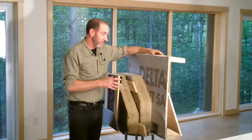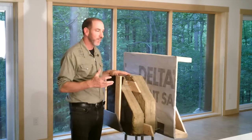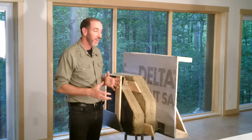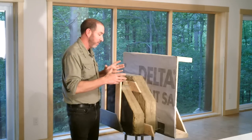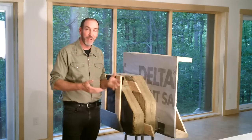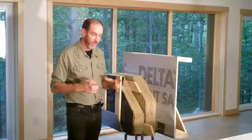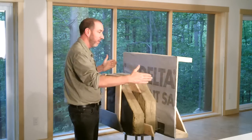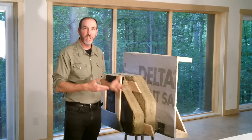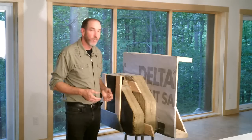There are other ways to do this — we chose the strapping approach. Exterior insulation is finding its way into building codes and people are getting that it's worth the investment. We tried to keep it within the realm of what's familiar to builders. There are also fiberglass clips you can install right on the wall that sandwich the insulation in without creating a thermal bridge — they're pretty expensive though. Having done it with strapping, it's a toss-up: a lot more labor this way, but lower cost. It's just a different way to try it — see what works for you.